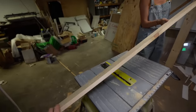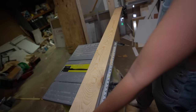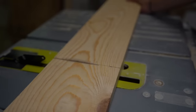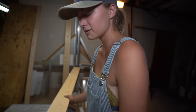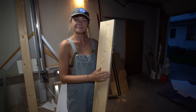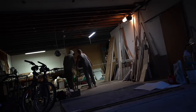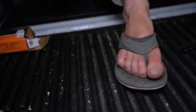That is perfect. The next step was to get the slats done. We started off with a 1x6 and cut five slats for the back. That took up most of our night, and then all we had to do was get them secured. The final step of the night was to get the top decking on. I ended up using three pieces of half-inch plywood, making each piece go vertically — the long way instead of the short way. This makes it easier for me when I want to take it out of my truck. I can just lower the tailgate and take them out one by one. Not only does this make it easier to take out, but it also makes it stronger. The wood grains going vertical rather than horizontal makes it flex less.